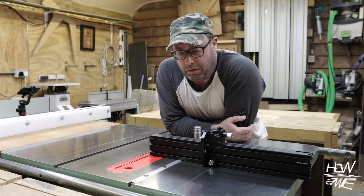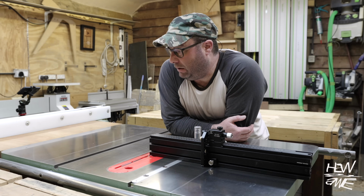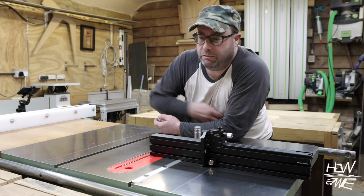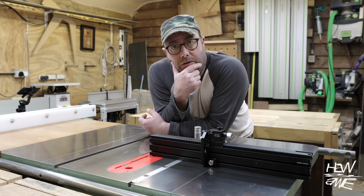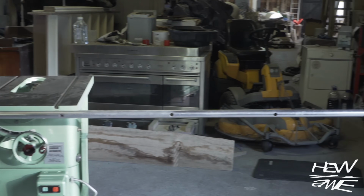And this is epic. I love this for the money as well. It's really good. The cut capacity of this saw is 850mm, that side of the blade. You could do 8x4 sheets, ply, whatever on this saw. It really depends how you configure these bars. These bars can be moved over here. The shorter ones you can get with a saw, and these bars can go right out there and take up the whole of that side of the workshop. I don't have the space.